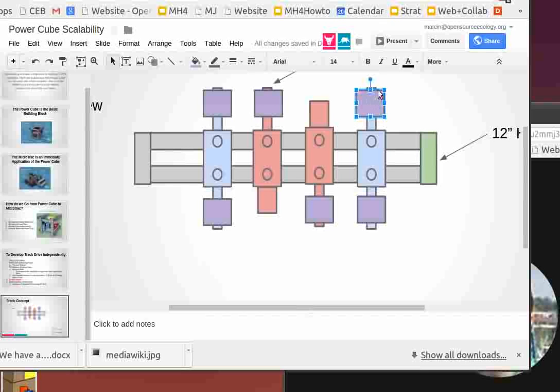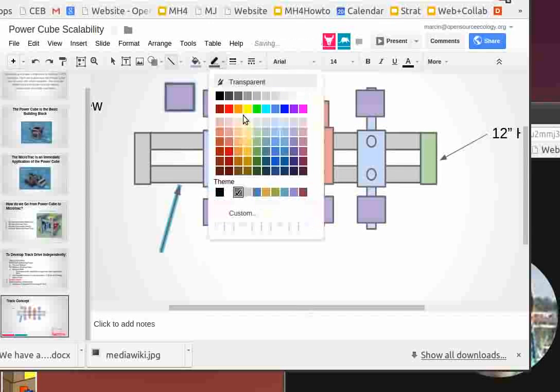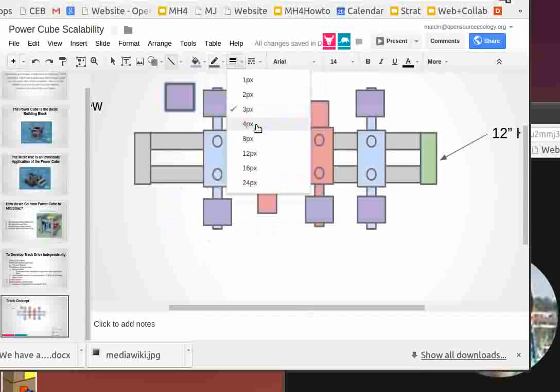So what I've just shown is that the width of this drive set for the MicroTrac could reduce the width of the MicroTrac. Remember we were having troubles with like 46 inches or something? This is back to 36 inches, because the shaft sticks out about 12 inches and then there's the drive cogs. So I'm gonna draw the track now in 3 points or like 4 points.